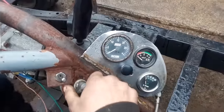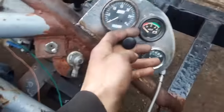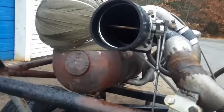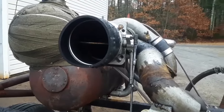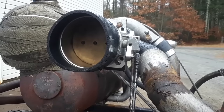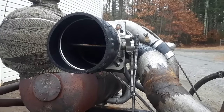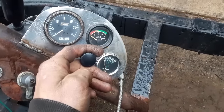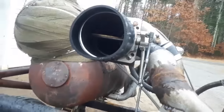Also, like I said, this trap door, it's a choke cable you pull. Follow it along, goes to a Jaguar bell crank for a V12 throttle body thing. Goes all the way up to a 4-inch or 105mm throttle body. Pull the choke, closes it up. Open it once it's running. It's also an emergency shutoff, but you have to pull it. It's naturally in an open state.